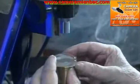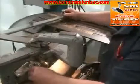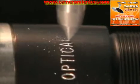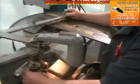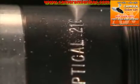Because the cement isn't yet dry, he can push the top lens around and adjust its position. They then prep the barrel that will hold the lenses. A technician traces out lettering using a stylus attached to a sharp tool that engraves information onto the lens barrel — technical details like focal length, the F number, and the size of the aperture opening. These reference points allow the user to pull a picture into focus at the desired magnification.